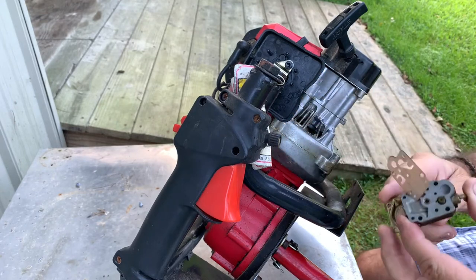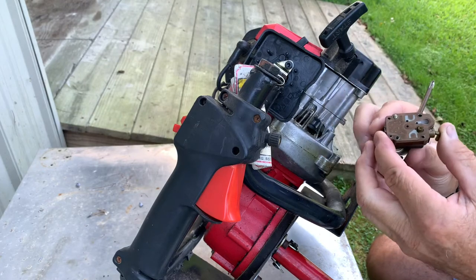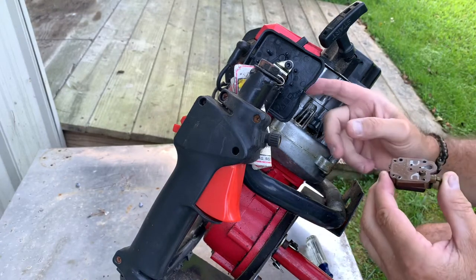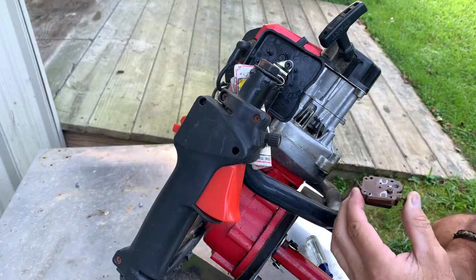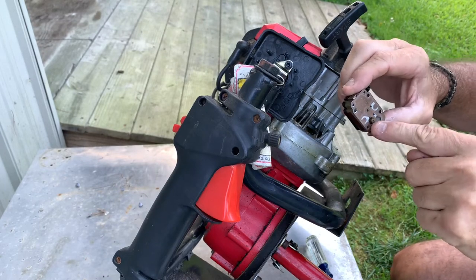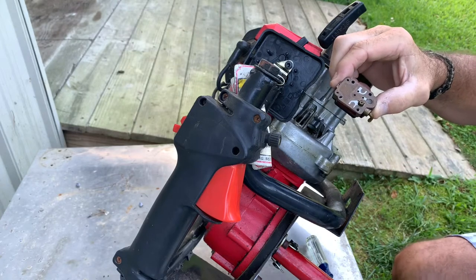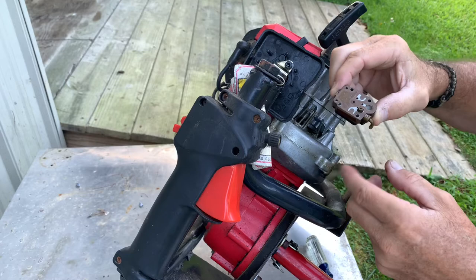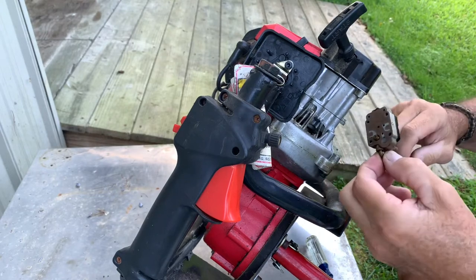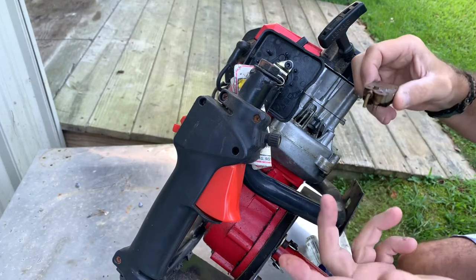But now that I'm older, and that gasket, you gotta be careful with that. All right, so I got that off, and there's another gasket right here, I'm gonna be really careful with that. But I'm gonna take this in, and all these little holes up in here, this is the intake. I'm gonna spray that all down with the Gum Out carb choke and parts cleaner, and blow it out with some air. Hopefully it'll pump back up, and give it a try. What do I got to lose, right?